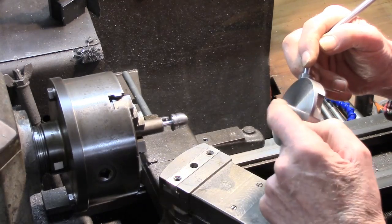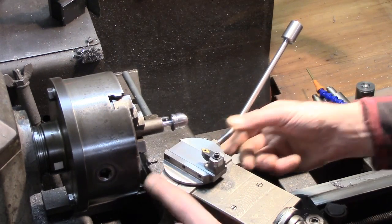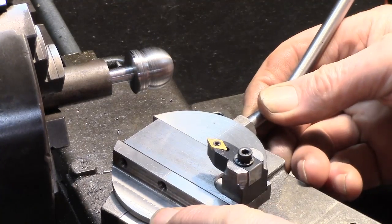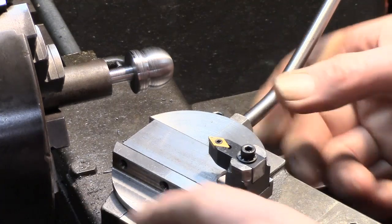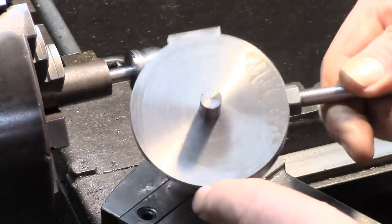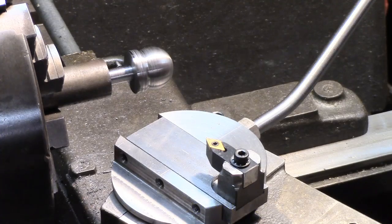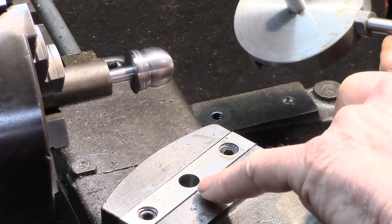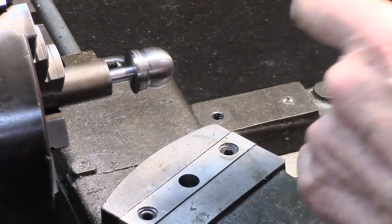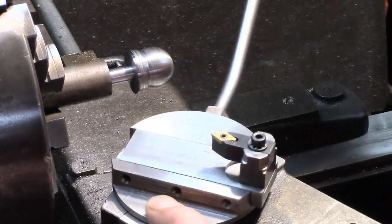I made a new pin for this and it's about a thou tolerance, but unfortunately it's still — let me just zoom in a bit — yeah, there's a certain amount of rocking on here, although everything's level across the compound. I'm not sure yet quite why that's rocking so easily. I think what I might do is get some real miniature bearings, one top one bottom, and then a smaller pin but a very tight fit in the bearings.